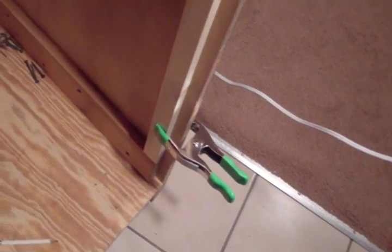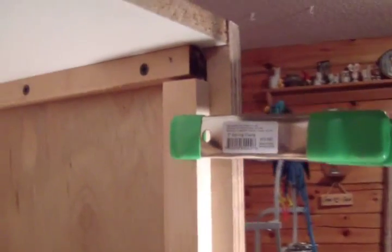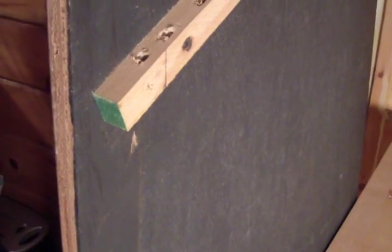And there's the other one we cut. And we got that cleat set at 3/4 inch all the way down. We can actually come back pretty soon and just pre-drill this and put some wood glue and some screws in and put this cleat in place. But we want to go ahead and do the other side first and just get all the cutting done, and then we'll do all the gluing and screwing up the wood at the same time. So we've got to do that piece, cut off about 1/4 inch, and we've got to cut off probably about 1.5 inches off of that or so.